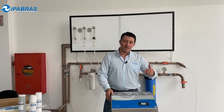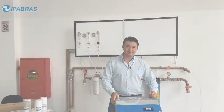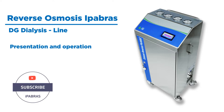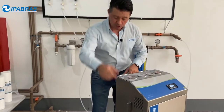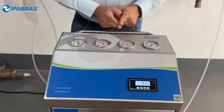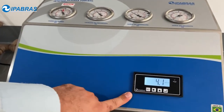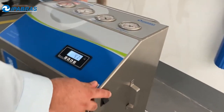This equipment is able to produce water for two dialysis machines at once. First of all, I'm going to show you the most important features of this machine. The first one is the very strong and robust stainless steel structure. On the front panel you can find four pressure gauges that indicate the pressure at different points of the water treatment, and a conductivity meter with alarm and buttons that can be used for recalibration.